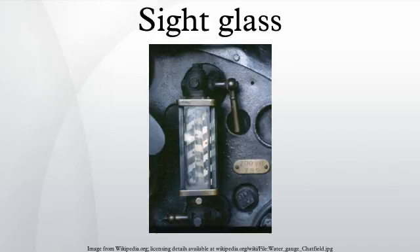Drivers are expected to carry two or three glass tubes, pre-cut to the required length, together with hemp or rubber seals, to replace the tubes on the road. Familiarity with this disquieting occurrence was considered so important that a glass would often be smashed deliberately while a trainee driver was on the footplate, to give him practice in fitting a new tube. Although automatic ball valves are fitted in the mounts to limit the release of steam and scalding water, these can fail through accumulation of lime scale.